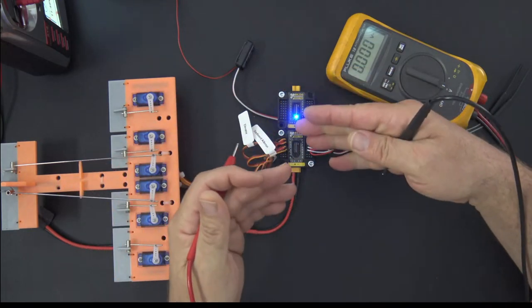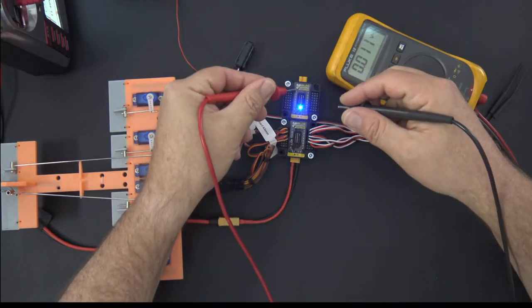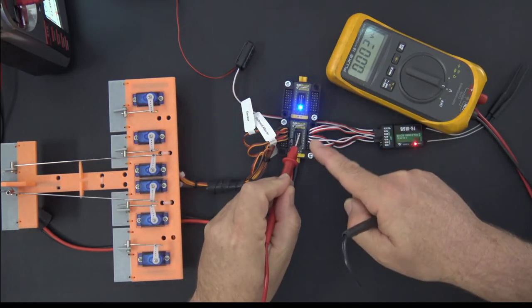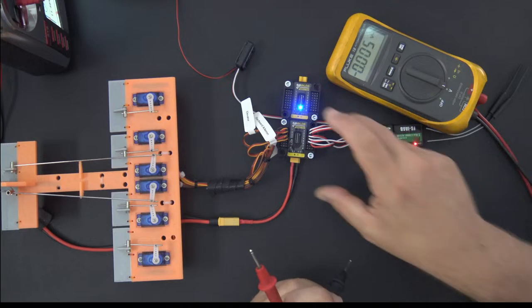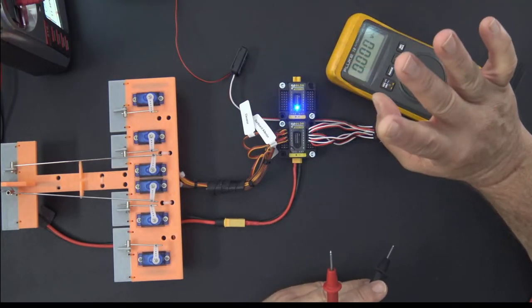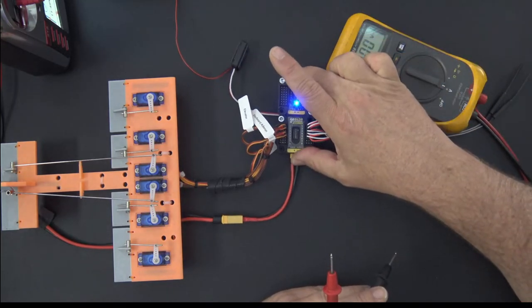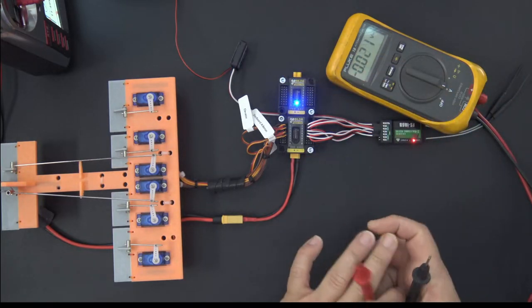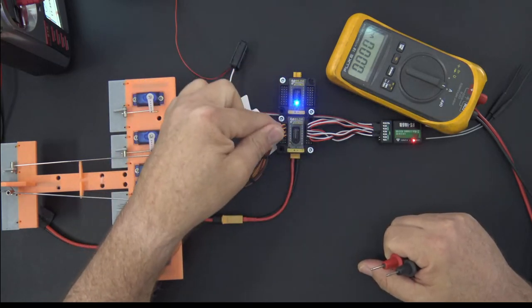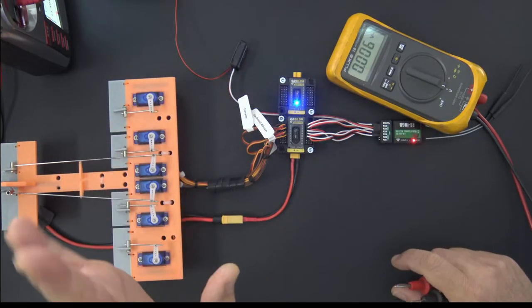You can easily convert this into a 16-channel layout. Very simple. All you would have to do now is just use these as channels 1 through 8 for your PWM input, and these would be channels 9 through 16. So there you go, 16 channels, and you can keep daisy chaining them. So if you need a much higher servo count, they daisy chain together, which is really cool in my opinion, because the XT30, no problems there, right? Plenty of current on the XT30 bridge, and this definitely makes it scalable. So I really like this as an option.